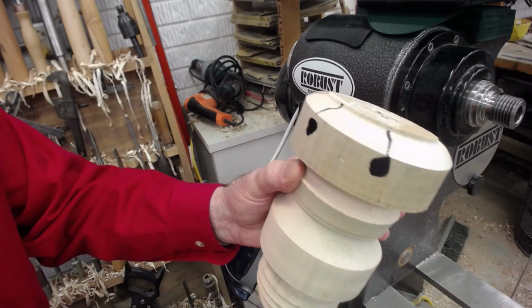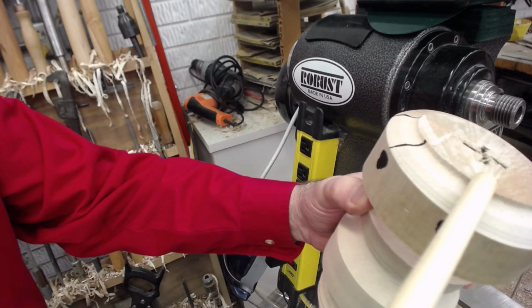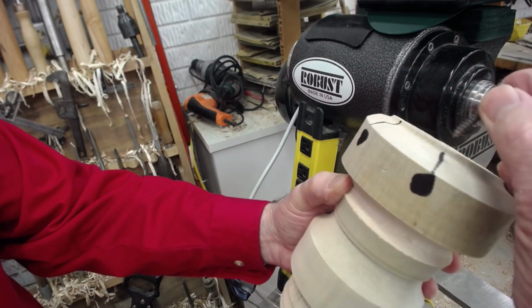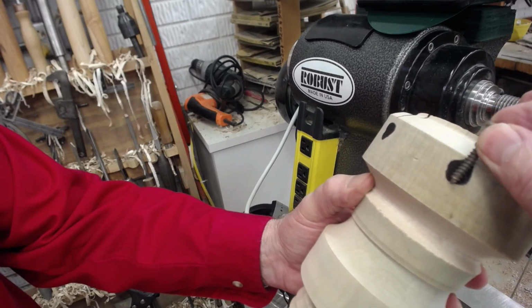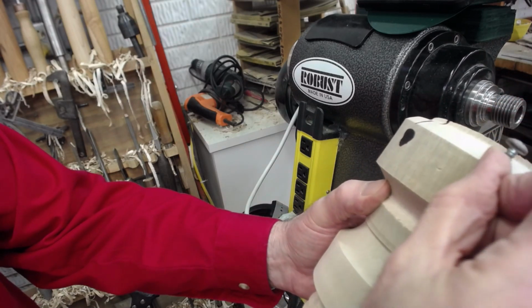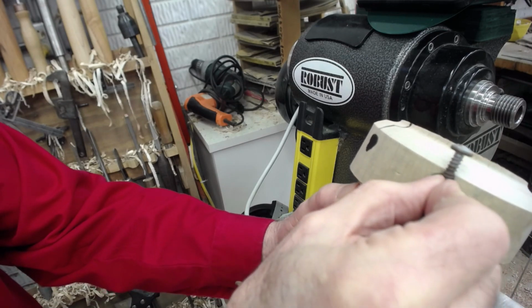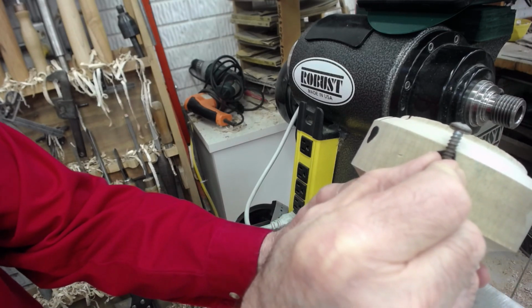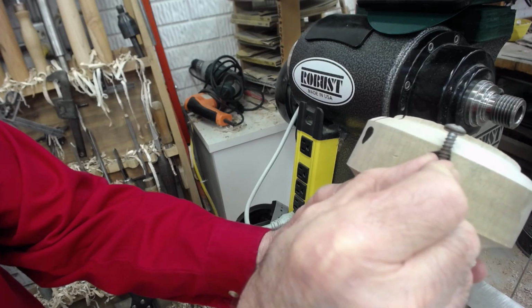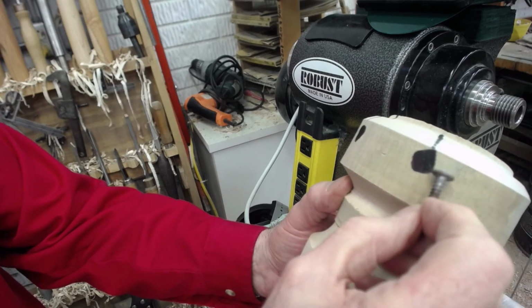Now, when I put the appropriate size dowel in that hole, the screw now is going to go down into the dowel and be very, very secure in the dowel side grain. And it's going to spread that dowel out and make a very strong grip for the screw to hold on to side grain dowel rather than the end grain fibers.